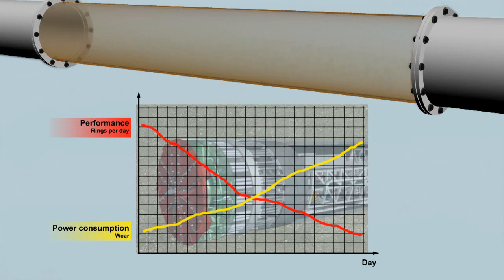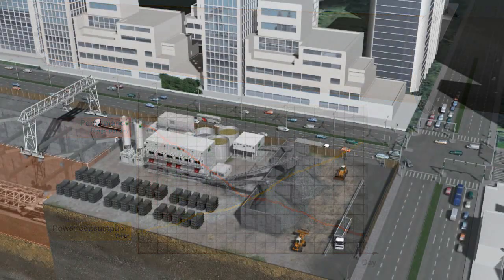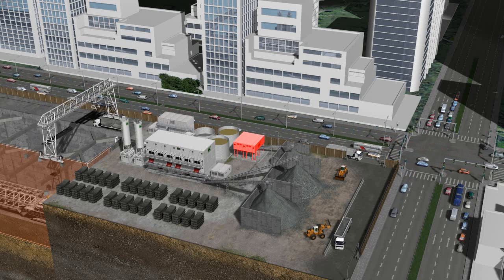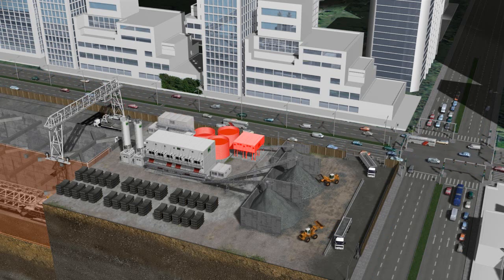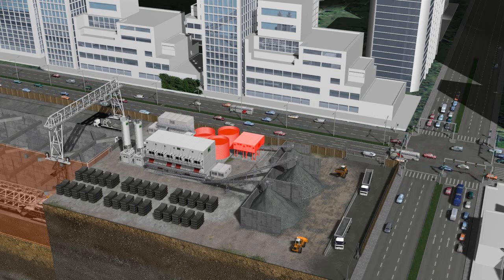The TBM can load less material on the medium, which is already preloaded with solids. This can be compared with a nearly full belt conveyor, which has hardly any spare carrying capacity left. Particles of less than 30 micrometers are removed with so-called decanter centrifuges. The finest particles are continuously extracted almost completely from the bentonite from the sedimentation tank.